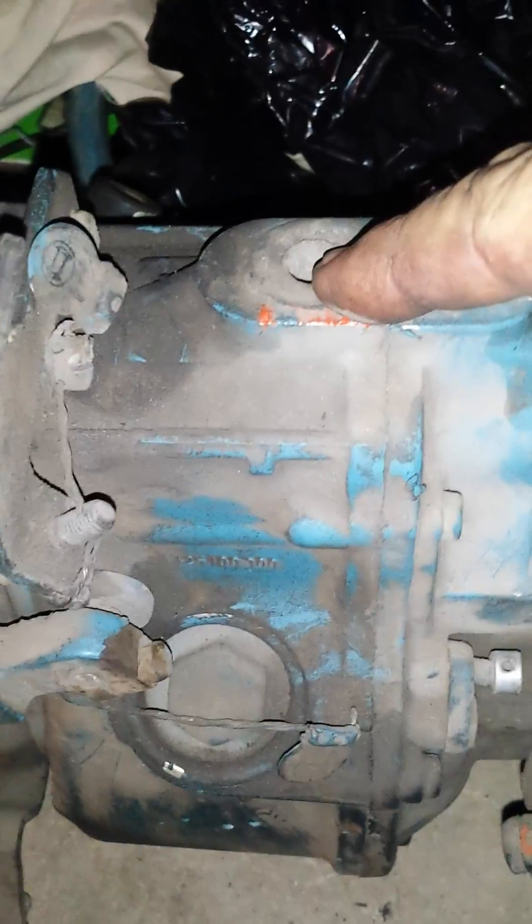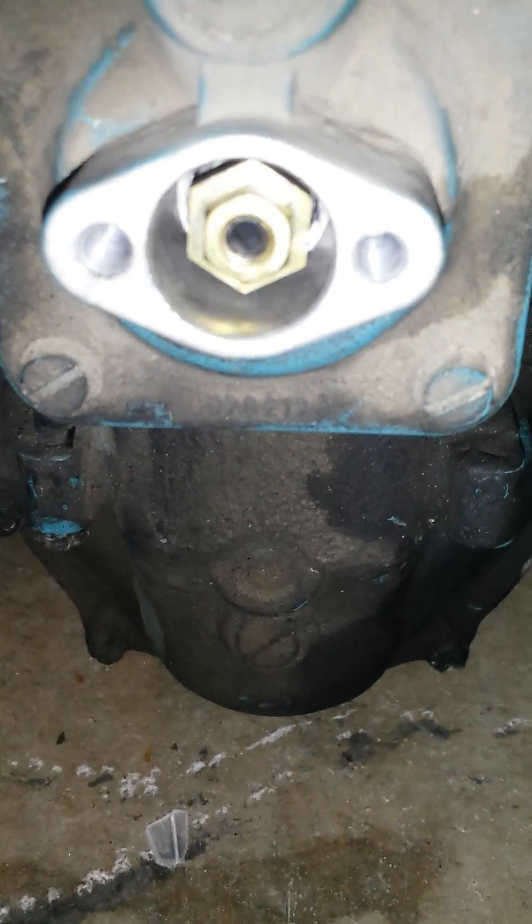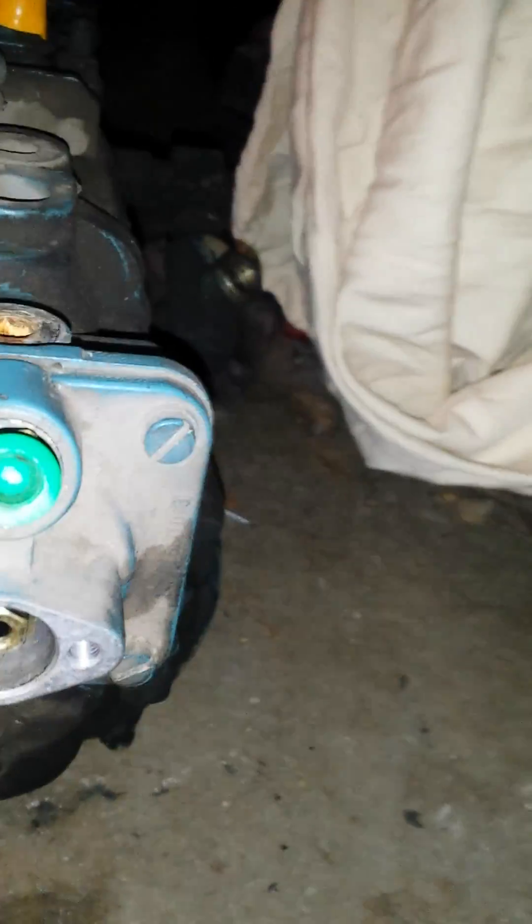So MW pump off a 466. A lot of you know about the screw on the top — there's your access to the governor springs, which is in the other video. And we got back here the actual full-fuel jam nuts. I already adjusted them; there's not even any threads left.